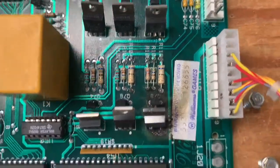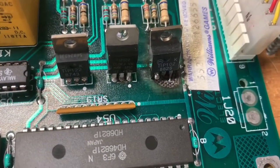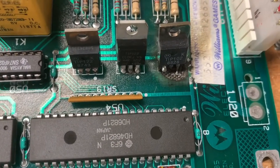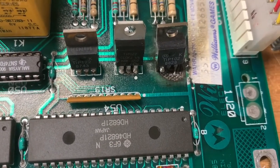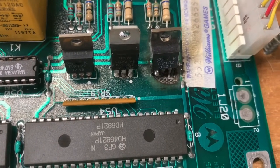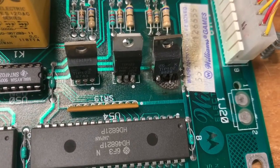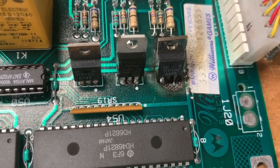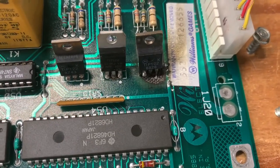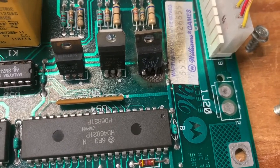Q79 here had roasted quite a bit, and you can see from the pictures I rolled in that it had toasted the PCB board. What you see there is not attached except for the left leg of this TIP102. The carbonized PCB board becomes conductive, so you have to take away enough material to eliminate any conductivity between any of the legs of the transistor. As you can see in the pictures, I had to cut away part of this PCB.